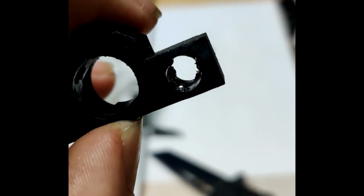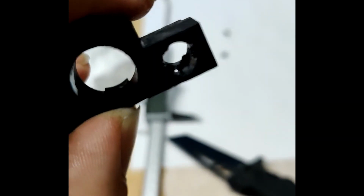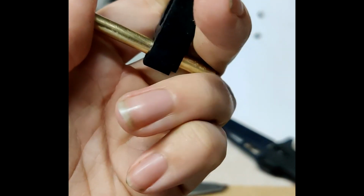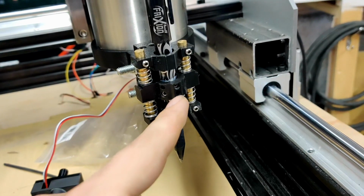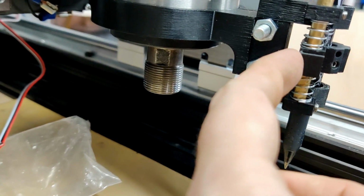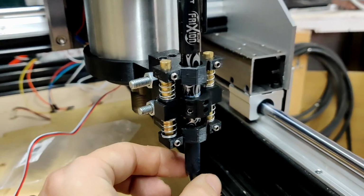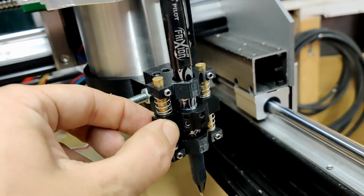It's kind of difficult to see, but in this attempt I've put 2 sets of 3 ball bearings at either end to provide the shaft contact points. Originally I had this carriage sort of sliding on this back, but that was too much friction. Even now, side to side has a bit of wobble because these springs can kind of let it do that.